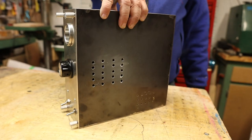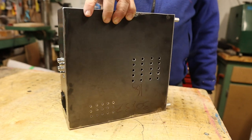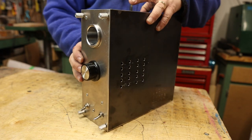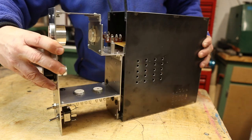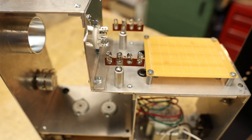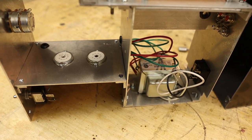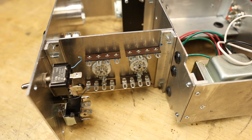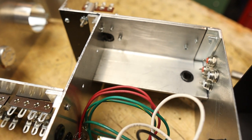All the fab work is completed and it turned out pretty good - I'm happy with the results so far. It just slides right out. I have the board for the power supply unit ready to be populated. I have the standoffs there for the regulator resistors, the tube sockets are all in, transformers in, and the terminal strips for the tube sockets are all done. I got the grommets for the pass-throughs so there are no sharp edges, and the RCAs are all mounted.